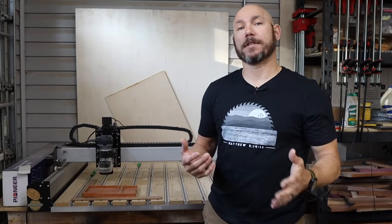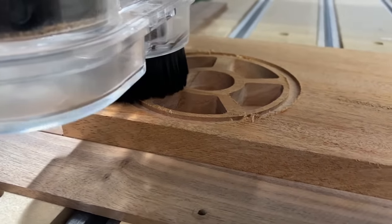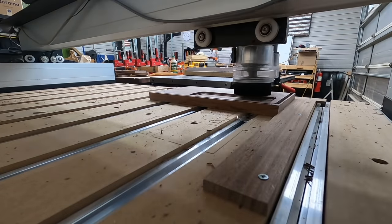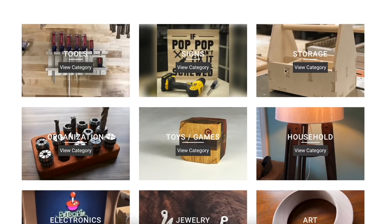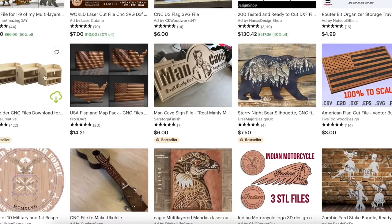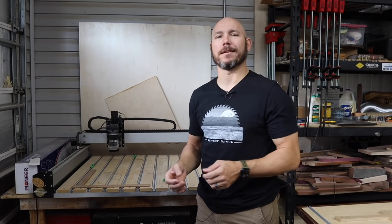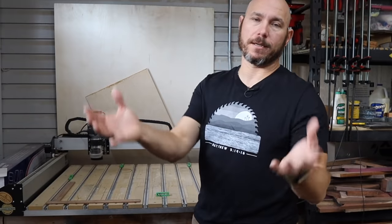On the negative side, I set myself up for failure more than anything. I thought I would get this CNC in the shop, set it up, and then just pick up files from online, put it on the computer, tell it to go, and let it go. That's not the case. Carbide has a website called CutRocket — there's not a bunch of them and you'll run out of files very quickly. I bought several on Etsy, and when I got them, they're just SVGs. I thought they would be Carbide 3D files, but with an SVG you've got to program everything in there just like you're building your own — set the tool path, what bit it's using, what feed it's using, how deep to cut. The whole nine yards. The only thing you've got is basically the outline of the project.